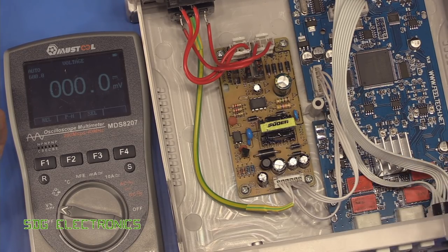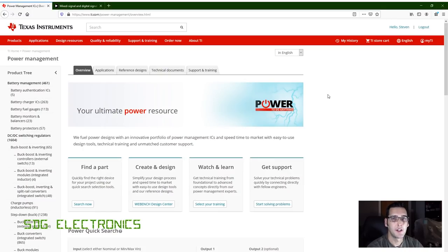Let's go onto the computer and start looking at some potential parts. The plan is to use a commercially available AC-to-DC converter to get our 24 volt supply from the AC mains, then design our circuit around that. Because we have one negative rail we're inherently going to have to use a switch mode regulator — you can't use a linear supply to get a negative rail from a 24 volt supply. So we're going to use switch mode regulators for all three supplies.